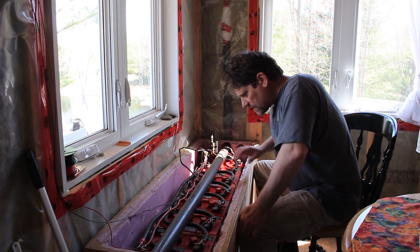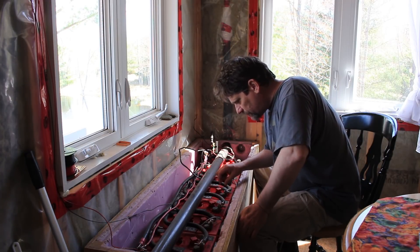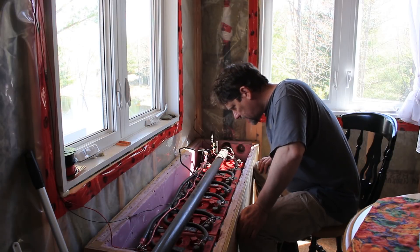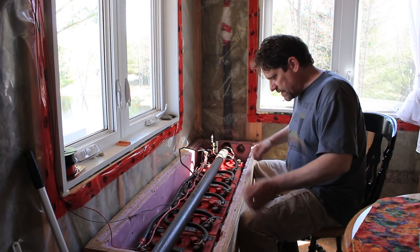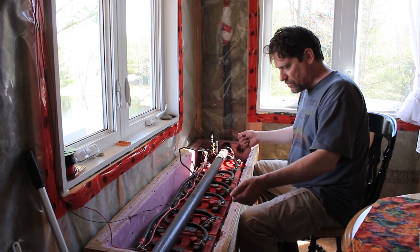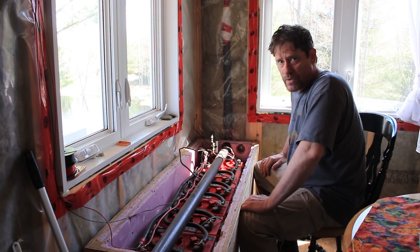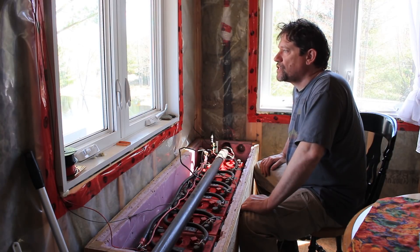So I found the resistance in the system right here on this bolt, because it was not screwed in tight enough. Which is odd because the cable had a nice flat connection on the battery terminal — it looked well connected. But anyway, I got my wrenches out and tightened it up as tight as I could. Then I checked the voltage again, and lo and behold, I was at 50.0 volts across the whole system, even with my loads running — my computer and my fridge. Oh, shit.